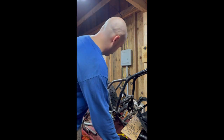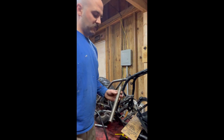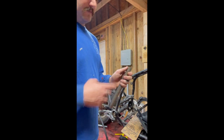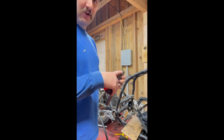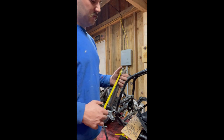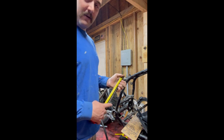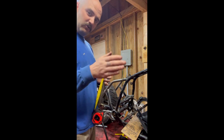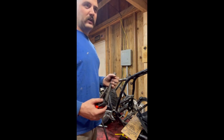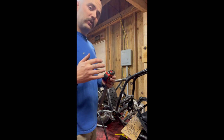So basically all we're going to do is cut another one out of this piece here. And because the inside diameter is 6 7/8, I'm going to take it over to the tube notcher, notch just the end off to get that round bevel, and then like I said, I'm going to measure from the inside of the bevel down to 6 7/8, make another mark, and that mark should be the outside of where your hole saw is going to cut into that, and that will give you the proper length. You don't ever want to cut from the wide part of the bevel, because then you'll be too long.